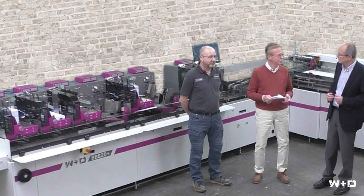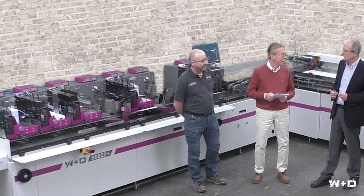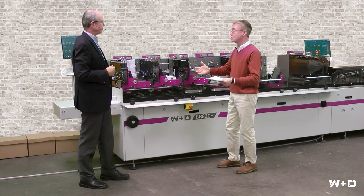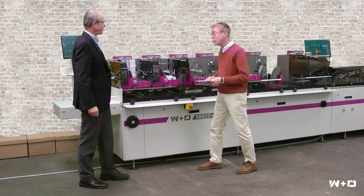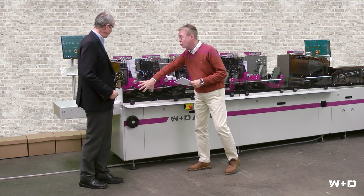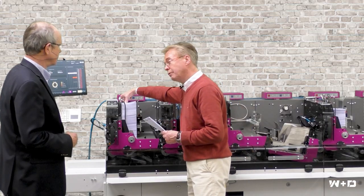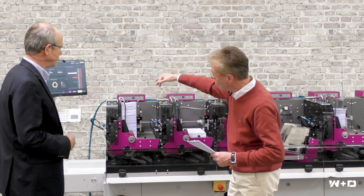Thanks Ernst. Obviously the platform of the BB820 Plus is continuously innovated, but there are two major areas of difference that define the BB820 Plus: our new rotary feeder RF4 and the innovations and improvements in the insertion module. The RF4 features improvements already introduced with the RF3 a couple of years ago — including the enlarged feeder drum and individual vacuum provision for the suckers across the product width.